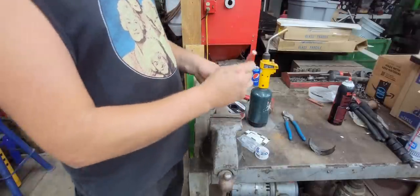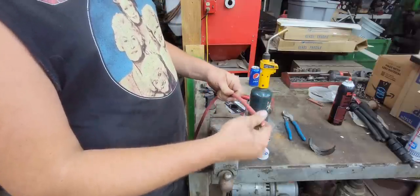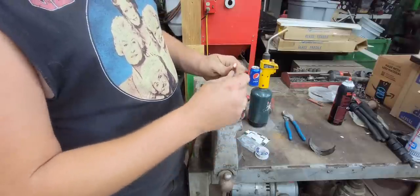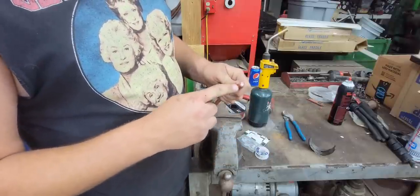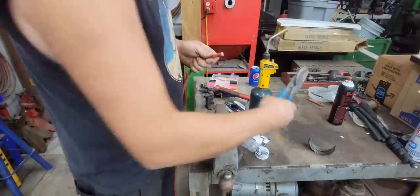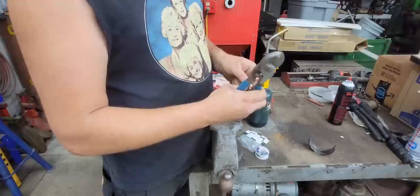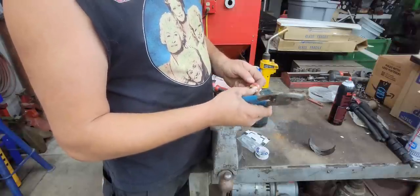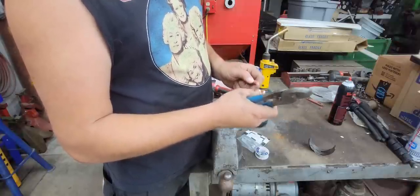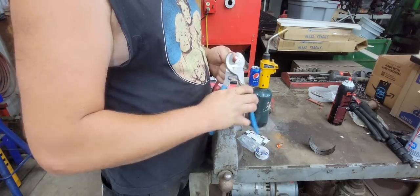So what I'm going to use is some bulk welding cable. It's welding and battery cable, but I like the fine wire to make my battery cables out of, because the fine wire seems to carry the battery voltage a little better than the coarse stuff. So we need to put a 3/8 eye on this end. This will go to the starter. So we'll get this insulation off of here.